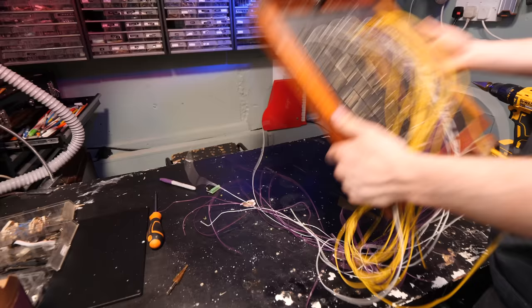There's a stripe on one side of a diode and this kind of denotes which way you want the electricity to travel. You can think of it in different ways, but if you make sure the positive potential difference, the positive voltage, is on this side, and the lower potential difference, the ground, is on the side where the stripe is, you can imagine the electricity just flowing on by.